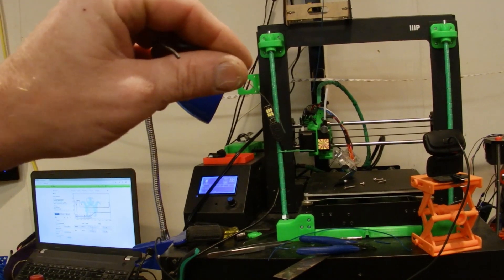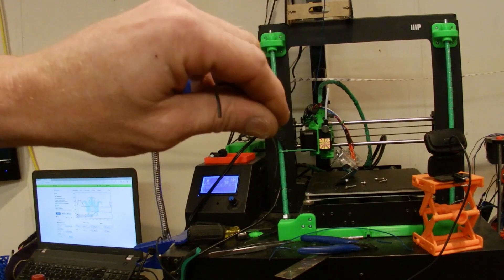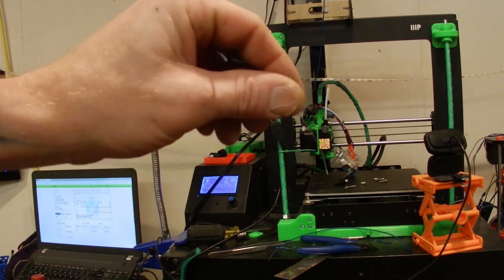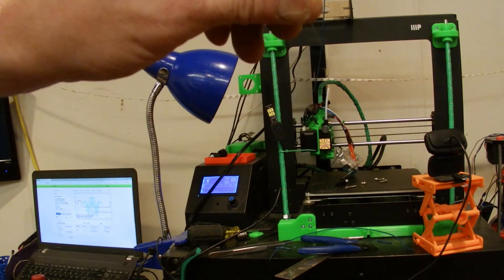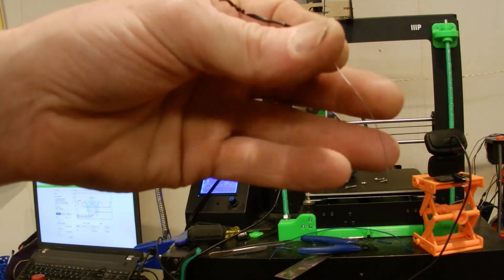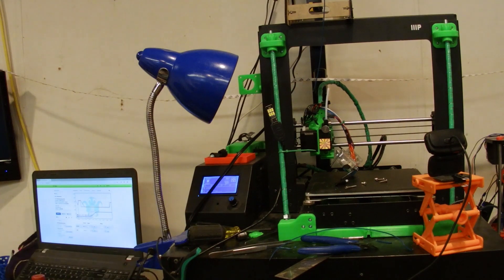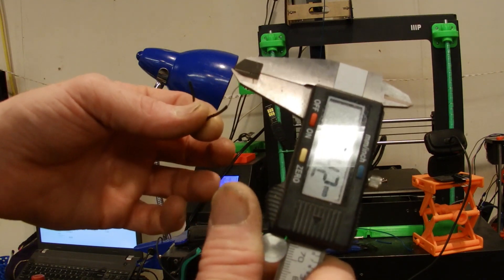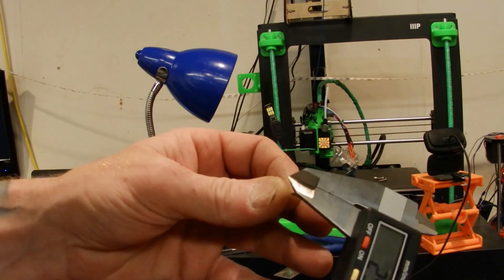One of the first things I've discovered is that because of the low printing temperature of this particular filament, you're going to want to make sure that you do a really good purging of your throat and nozzle. I've actually disassembled mine and I'm doing a little manual cleaning — it's about that time. I'm using a bread tie and it's just about right, though it might be a little too big actually. I'm trying a resistor to see if it works a little better.